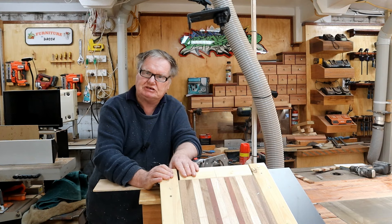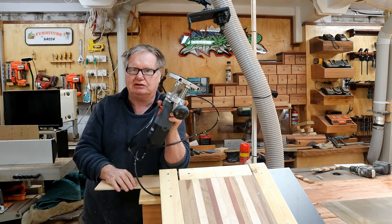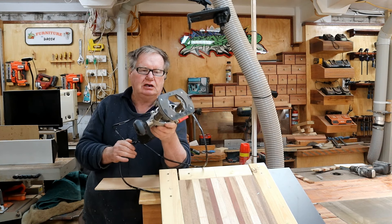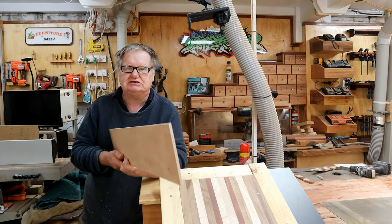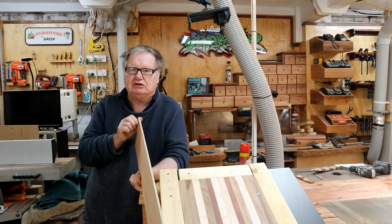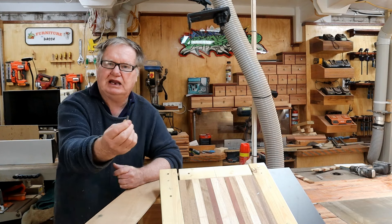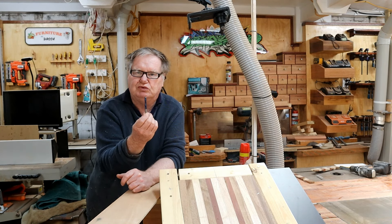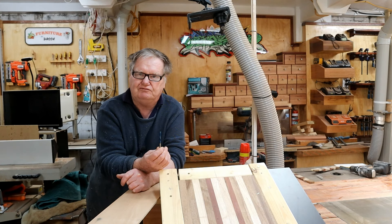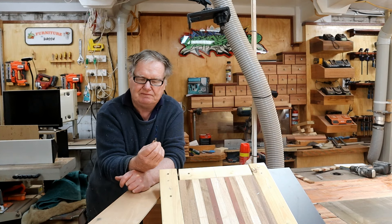The main jig is all finished now - we've got the board securely locked in there. Now we're going to start on the second part of the jig, which is the router part. You need a router - I'm going with my little cheap router from the big box store. Once it's set up I'll just leave it set up. For the plate I'm going with a bit of 6mm ply - you don't want anything too thick because you've got to go through all the timber and the plate and lock it into your router. For the cutter I'm going with an upcut spiral quarter inch bit. I normally go for downcuts but I want to clear the groove since we're doing this in multiple passes - the cutting board is 35mm thick, so we're going to do it in about 10 or 12 passes. Just take a little bit at a time - don't put your tools under pressure.